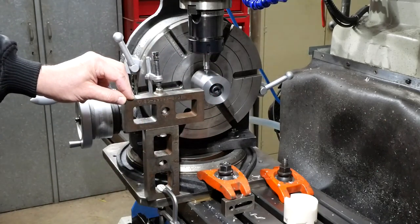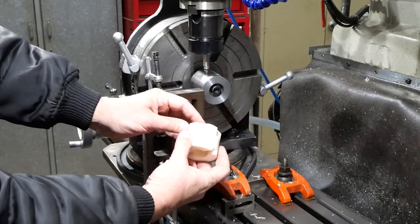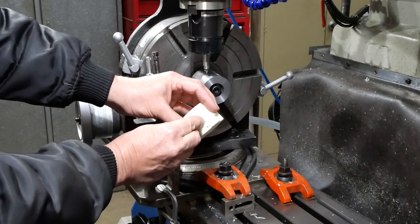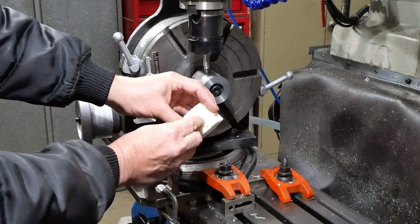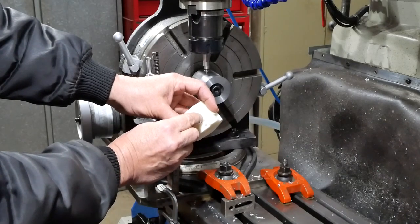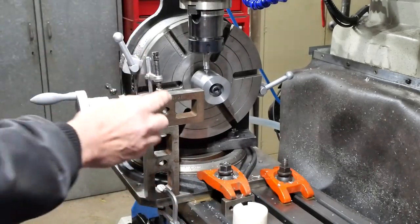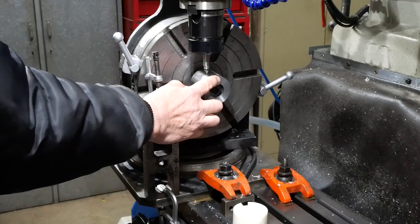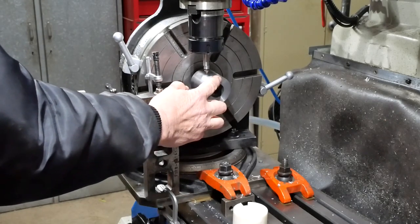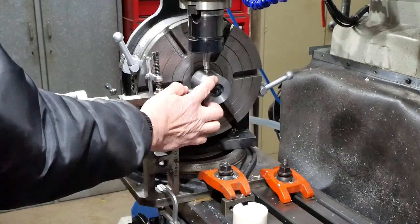So by then I've got a point in the middle on that front edge, and through my CAD drawing I was able to work out an offset from that point back to an index where I've drilled a hole in the corner of the pocket and call that an index hole. So then all the other features I've worked out from that. So if you think about it, the exact location of the inserts isn't that important, but what is important is the dimensions of the pocket and the attaching features, the holes within the pocket.